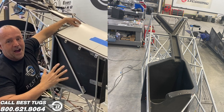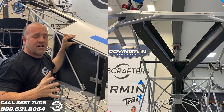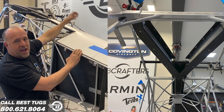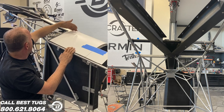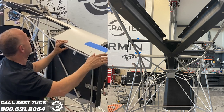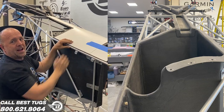Once the parachute's out and it opens, you don't have to worry about how much force it takes to rip the rest out, because now the weight of the aircraft is under canopy, and the entire weight of the aircraft pulling on these big 2-inch heavy-duty straps, they're like a tow strap for towing vehicles, will then just rip the rest of that track out and sling the aircraft and bring it down slow. So that's what I've got to do now. The fit worked out great. I've got to put some paint on it, reinforce the backside.